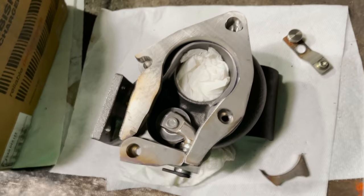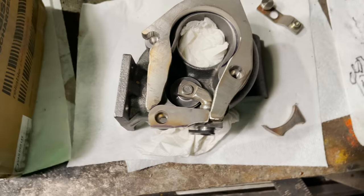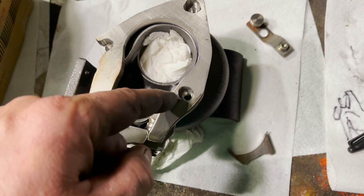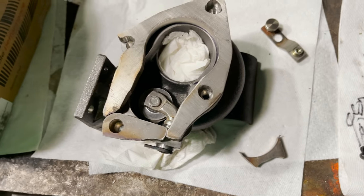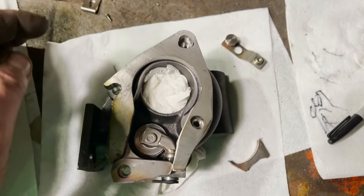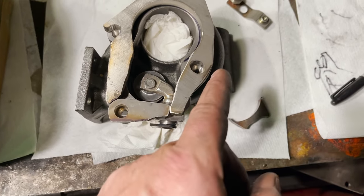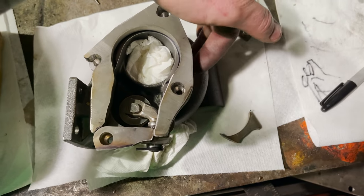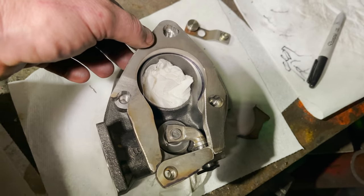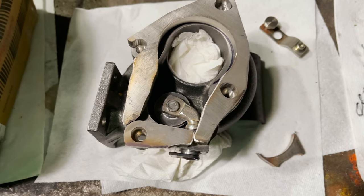I cut out the center divider, cut off the end, flipped it around, ground it, cut some pieces, and fit it back in there. I had to put the flange in the mill a couple of times and kept having to change where I was milling the hole — I think I bent it when I had it in the mill. But I've got room now with a washer and I'll be able to clamp those down. It's going to be a little tricky because the pipe fits fairly close, but I can bend it in a little bit to make sure there's room to get a nut on the stud.